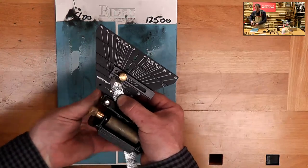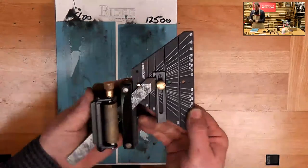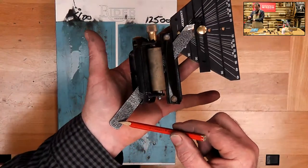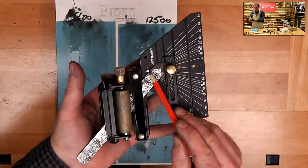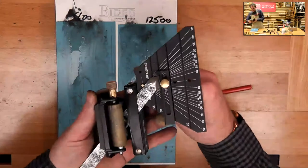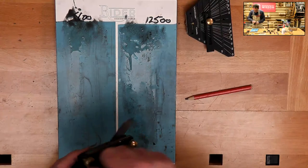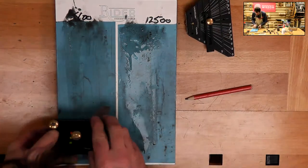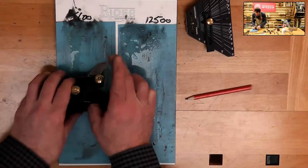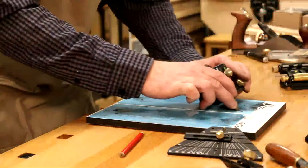Turn it around. Okay, get this in a bit nearer so you can see what we're doing in a sec. Okay. So you can see, I said it's quite an angle. Look at the back of the knife handle. It comes out here across, resting on the brass pin, up to our stop plate. I can undo the collar, get that off. Check things are tight. We can then carefully, and I've got to be careful because of where the pressure needs to be. So my fingertip, right hand is more important for this.